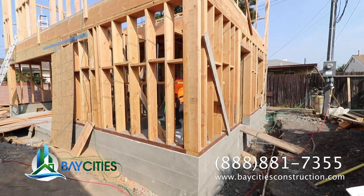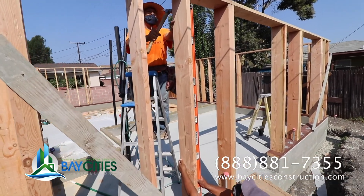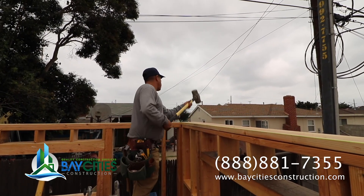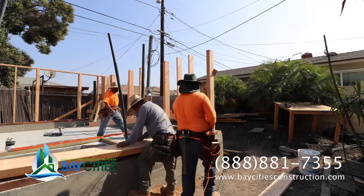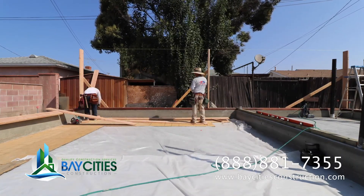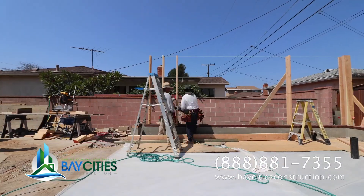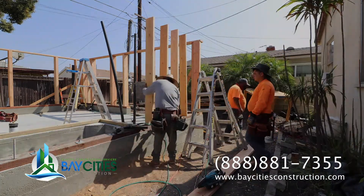Let's recap from the ground floor. You can see the guys not only putting the walls together, but also making sure that the walls are plumb and square. You'll see us slamming the top plate to make sure all the nails are driven home and that everything is sitting as intended. It's really important to make sure the building is square, and it can be a little tricky. We weren't able to assemble the walls on the floor — we basically assembled them vertical stick by stick. It was a little slower, but because of the way the building is set up the walls would have been too heavy, and we don't have the ability to put a crane in the backyard to raise the walls. So we chose to assemble them this way.